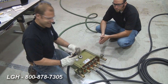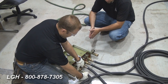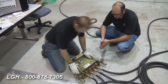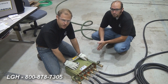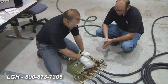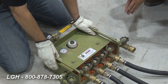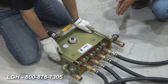We have four 30-foot hoses with quick disconnects. We'll pull the valve back, engage the hose, and put it back in. To operate this, the system on the manifold will have a PSI pressure regulator, and that's where the whole system will start from. From these manifolds, we can control each one of the individual tiles to regulate not only PSI but also the flow. The heavier the component that we're lifting on one side, the more flow that we'll require.